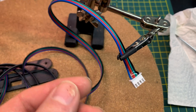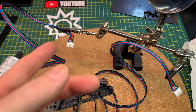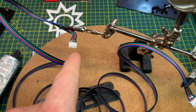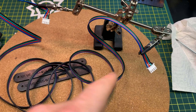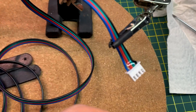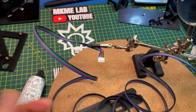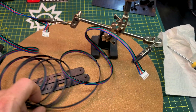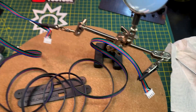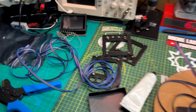It's kind of similar to the consistency of hot glue but it's crystal clear, and it soaks in - it's a little runny initially and it flows into connectors and permanently seals them up. What I do with these cables is just put a little layer, let them cure for a few hours, flip it over, put another layer, and let it cure up. Then it's permanently bonded and I can send these out without concern that someone's going to reef the terminals right out of them, because they don't know how sensitive JST cables can be. Pretty cool - learn something new every day.